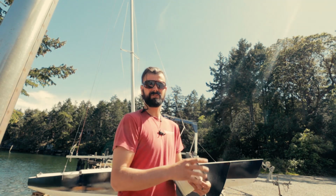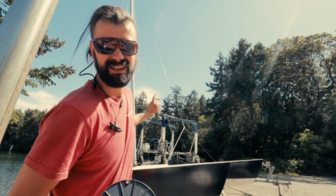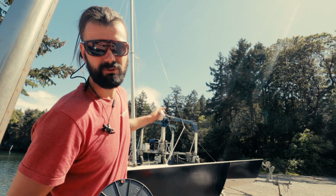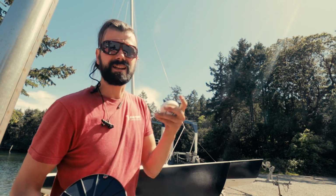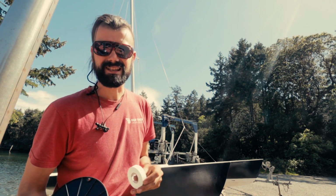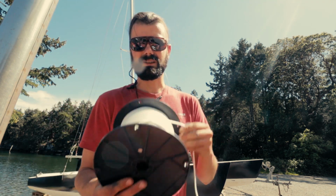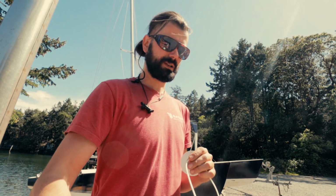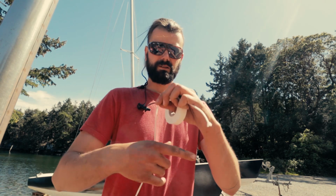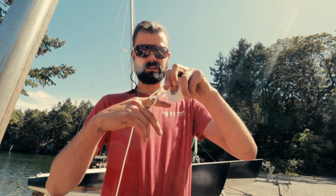All right, so as you can tell, one of the halyards is broken. It snapped just a few feet from the bottom on the stainless wire. So I'm thinking that I'll pull it out and see if I can replace it easily. And in order to do that, I need to use this chase line here, feed it up around the other piece of stainless. You gotta wrap it with a special knot that tightens on itself.